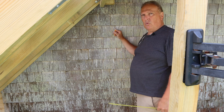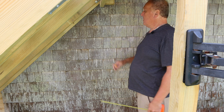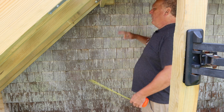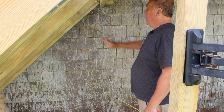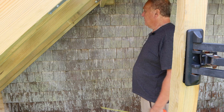And if I have to redo all of that and take the room down to replace the AC, that's not going to be pretty good. So I'm going to make it a little bigger than the AC is. That way I can insulate it and all that. And then when it dies, I remove it, and I'm just going to have to change the trim here to secure it, you know, weather tight.